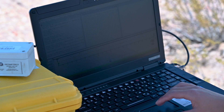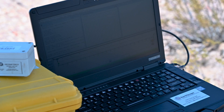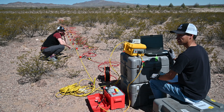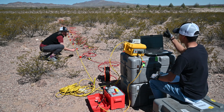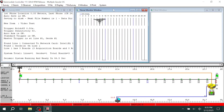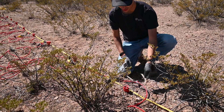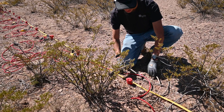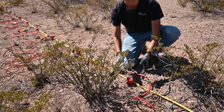From here we're going to do a stick test first to confirm that all our geophones are working. To do that, tap next to each geophone in the ground and confirm on the computer that we see the response. As you're going through the stick test, you can also confirm there is nothing producing noise in the line. For example, if there are twigs over a geophone, clear those out and make sure nothing is touching it, because anything rustling against the geophone will show up as noise.